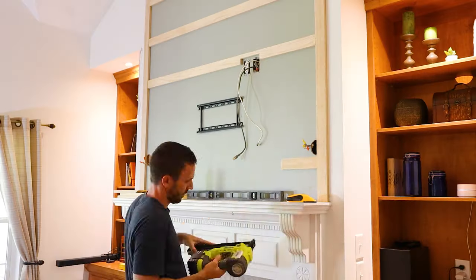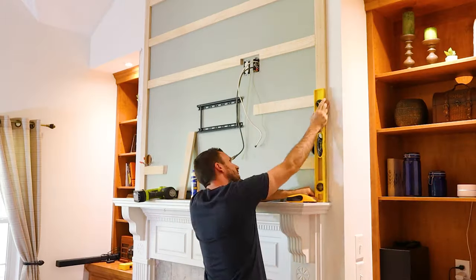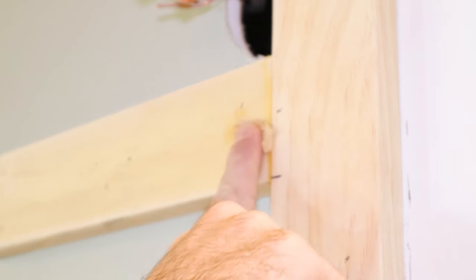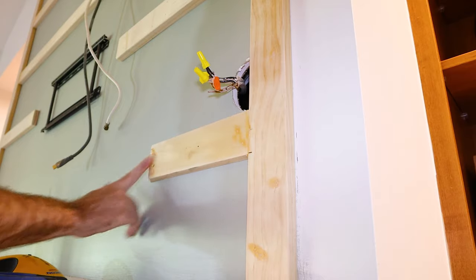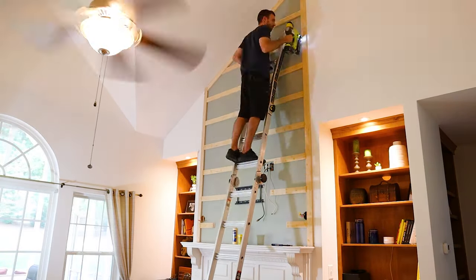It's up and it looks good, but it's time to clean it up by filling in the nail holes and caulking the seams. I'll use wood filler for the nail holes — you can use spackle too. The top of my wood filler was a bit dry but got easier as I went. This is Minwax branded — they're not a sponsor unfortunately, though I use and talk about them all the time. I have links to all these products in the description below. This was quite a tedious part, so I'll fly through it.